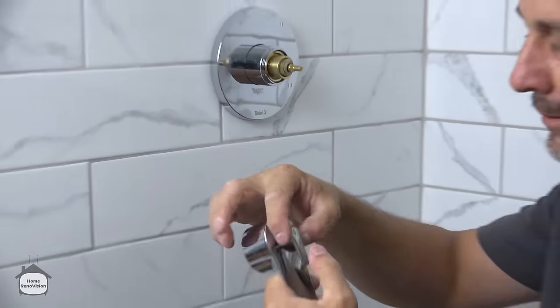But even with a shower head that gives you great pressure, you don't have enough pressure in a rain shower head traditionally to clean soap out of your head if you got a lot of hair, unlike myself. So if you have shoulder length hair or longer, you're going to need more pressure, which is why we're going with a 3 function. Now it is time to put on the shower rod. We want to go with this one first because it helps to establish, aesthetically, where the rod should go. Now we'll install our adjustable shower rod, and I'm going to show you the secret.